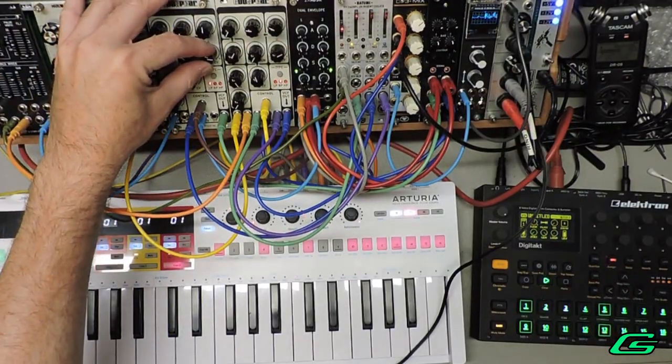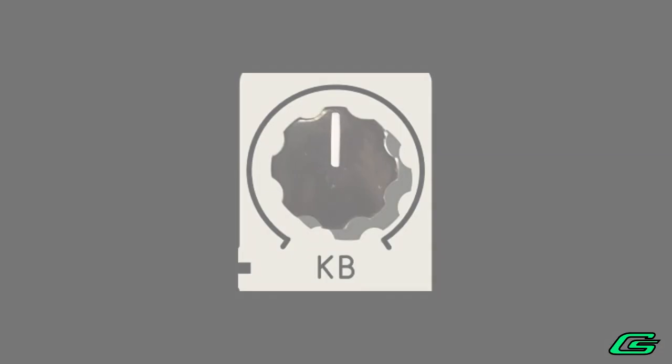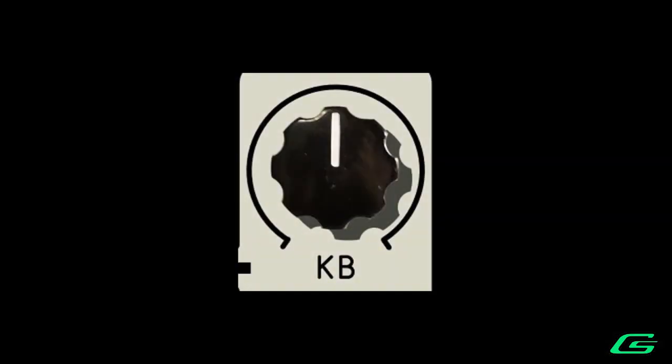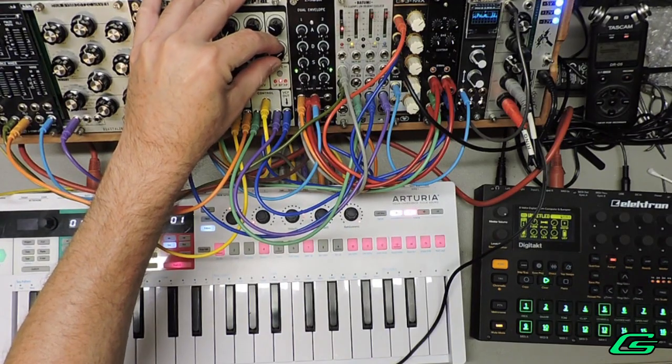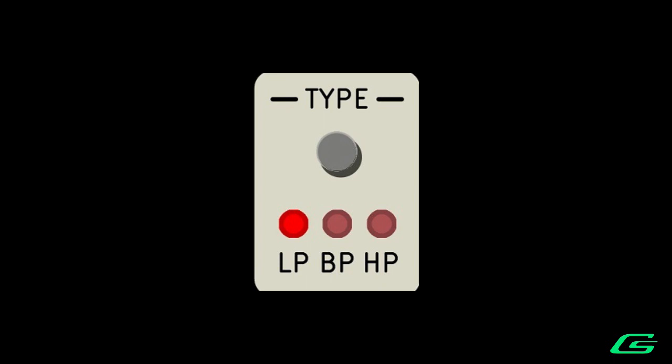The key resonance control can emphasize the fact there are now two peaks. Using the keyboard input, the filter has decent volts-per-octave tracking of self-oscillation resonance. As a multi-mode filter you get low-pass, band-pass, or high-pass modes, and an additional CV control of frequency with input inverting.